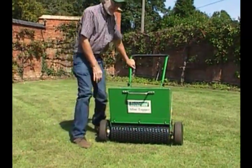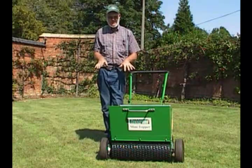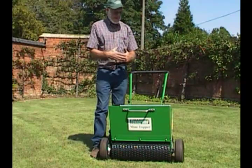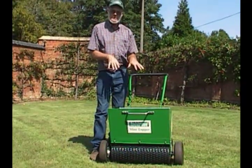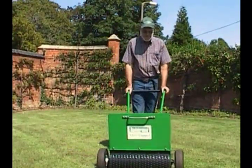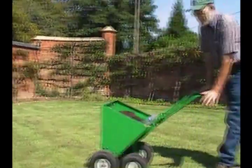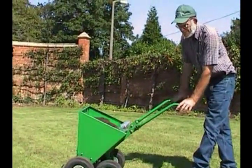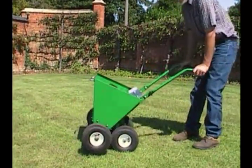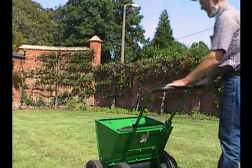Furthermore, and we'll cover this when I get a little less in it, we have a rear calibration plate that wobbles. This vibratory plate calibrates the amount of material that the drum will take away. It also vibrates should we get moist material that tends to bridge in the hopper. We've placed it on 4 pneumatic wheels to make it very easy to maneuver. To stop the flow, we just raise the machine slightly on the rear wheels because the front wheel drive is what is driving the drum itself. The handle is adjustable for different heights, and we do have a lifting handle on the front for loading.